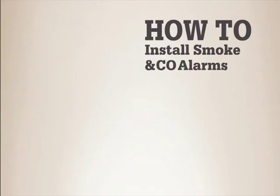But did you know, when it comes to smoke alarms, there are two types of technology available. Ionization detectors sense flaming fires more quickly. Photoelectric alarms detect smoldering fires more quickly. It's not a question of which type is better. Your home should have both.